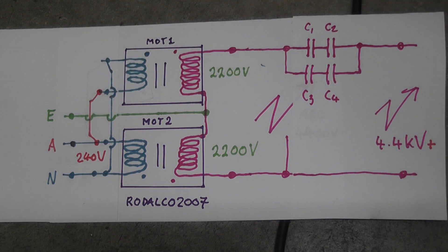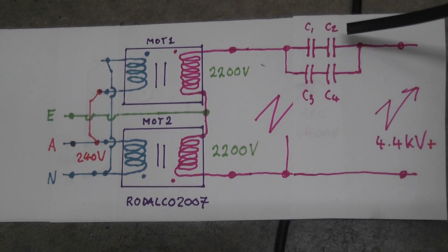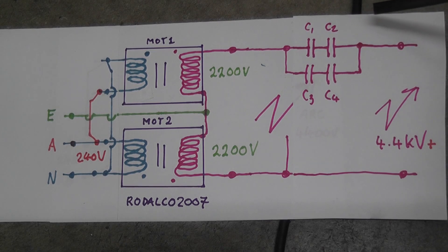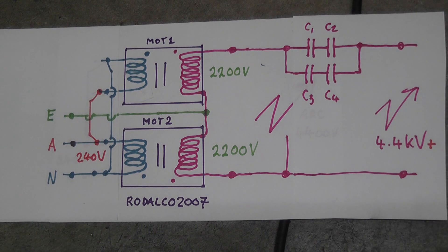I was also mentioned about capacitors in series — that's no problem. You need four capacitors to maintain a one microfarad capacitance. If you put two in series, that makes half a microfarad at 4kV or 4.4kV. Double-parallel them up and it ends up the same: one microfarad at about four to four-and-a-half kilovolts.